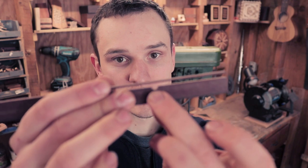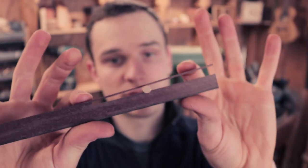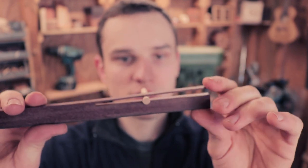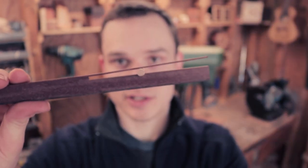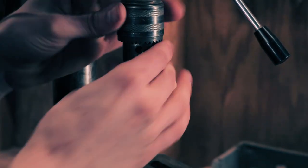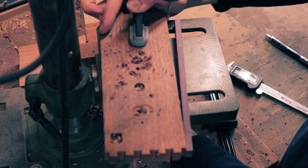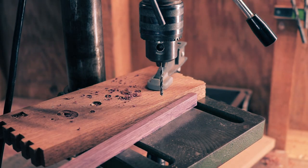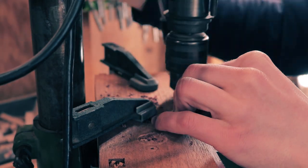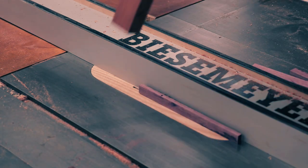This is just the test piece, but I just drilled a hole here and then cut right through it. Then what I'm going to do is add a little dowel in between. Of course this is blown up — it's going to be smaller than this. Then you'll have this type of flex. The nice thing about this spring is I wouldn't rely on wood springs to hold their tension over time if they were in a flex position, but this one is going to be at rest in this position so that the only time force is applied is when the mechanism is actually working.